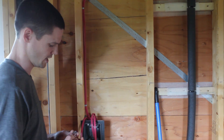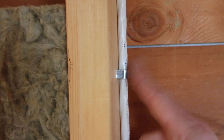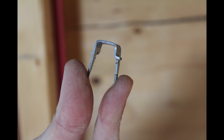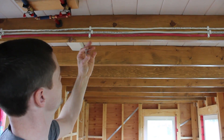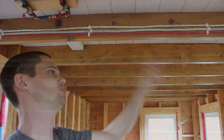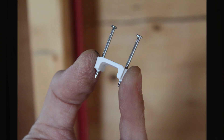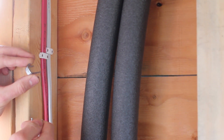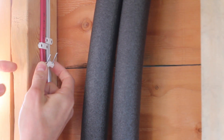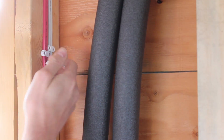To secure the wires down, I've always used these metal staples — it's just what everyone uses around here. There are big ones good for two wires laid flat on top of each other, as well as for the three-wire type of cabling. And smaller ones good for a single two-wire cable. But over here where we're fastening into the stained joist, I didn't want to use the metal ones because they tend to chew up the wood quite a bit. Even though it'll be covered in the end, I went with plastic ones for a cleaner installation. I've seen them a lot and always thought they were kind of hokey, but after using them here I sort of understand their purpose. The metal ones can be a lot faster because you just bash the whole thing in one go. But the little nails on the plastic ones are much easier to sink individually — so in a spot where you don't have a lot of room to swing, you can still seat them down all the way and get it nicely secured without much difficulty.